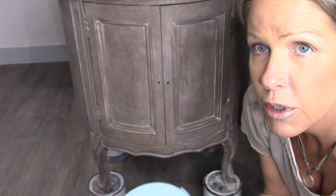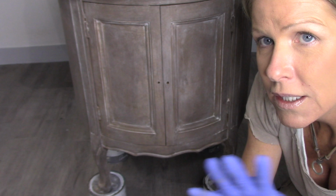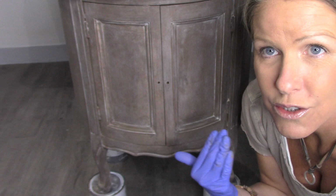This can be applied to anything, even if you're painting decor things like vases, and you just want this organic texture, kind of similar to what dark wax does, but you have a little bit more control. The key factor is to put some clear glaze first, then put your color, because if you don't like what you've done, you can just wipe it away. Easy peasy.